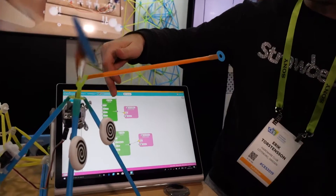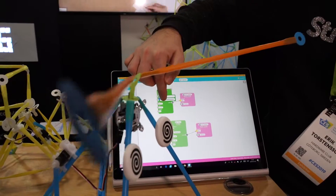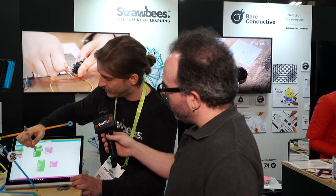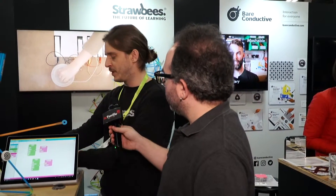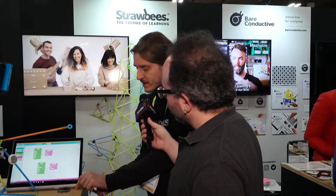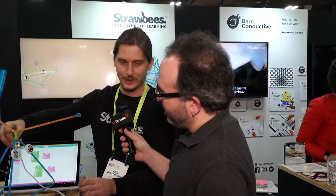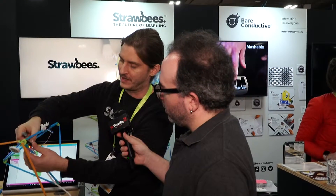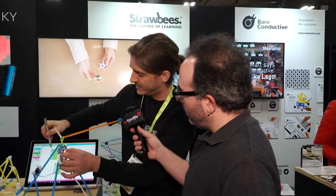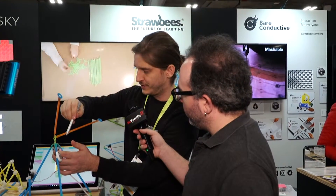If I want to change the wave to make it work faster, I go in and change the wavelength. I can slide it down - let's go down to a 0.72 wave. To upload that to the robot you take a USB cable. We chose a cable interface because it also charges the robot. I want to make my change in the code on servo output number one - you see the wave here - and I want to make it faster, so I change the value. Now it's connected and we upload. The code should be transferred to the robot.